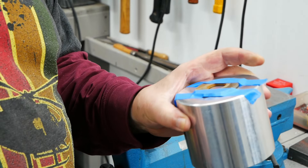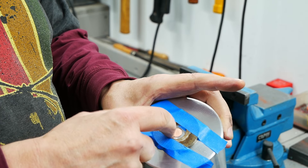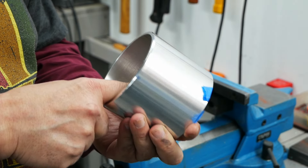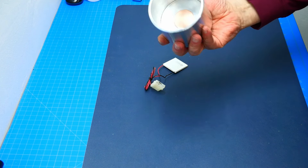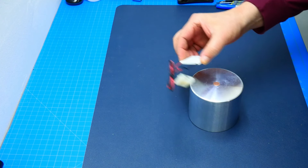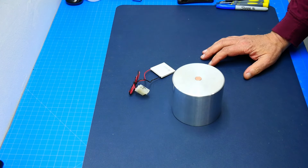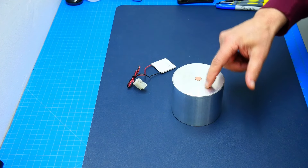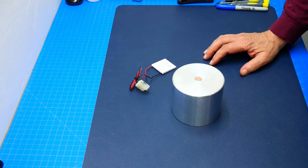I put a washer on it so the shaft could protrude a little above the surface of the aluminum, since it was a hair longer — but it's all in now. Now we proceed with the milling part. Here is the TEC module I salvaged from the old fridge. The copper core is inserted and sticks out a little but that's not a problem. I'm going to recess a very shallow area for the TEC module — just a fine outline so it sits and doesn't shift around when mounted.